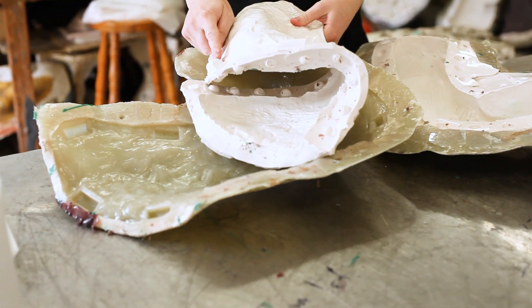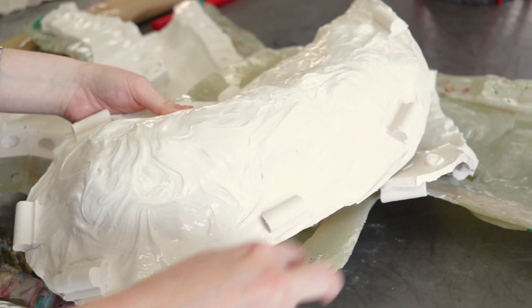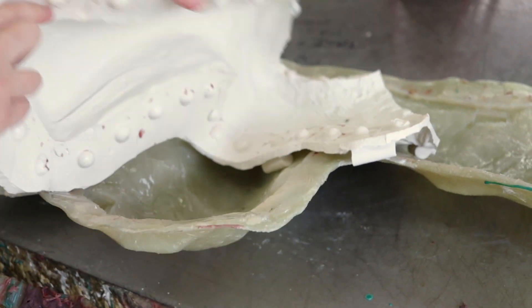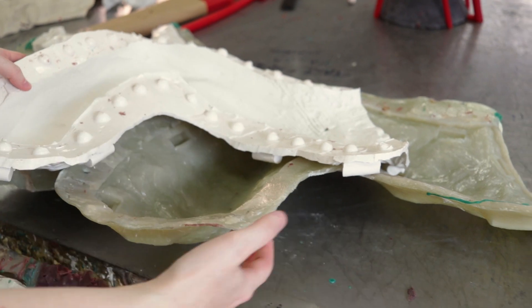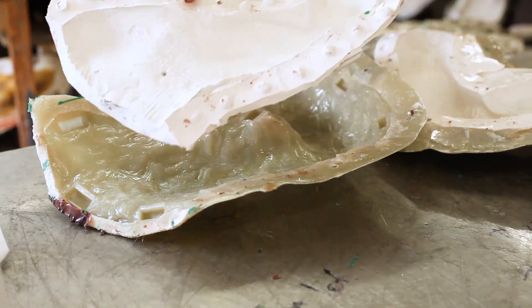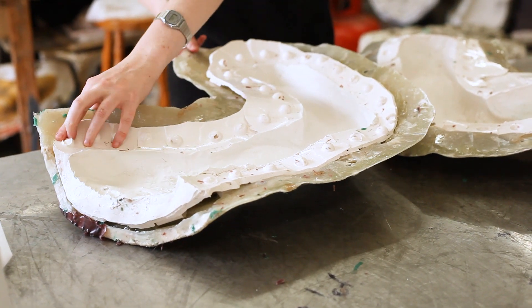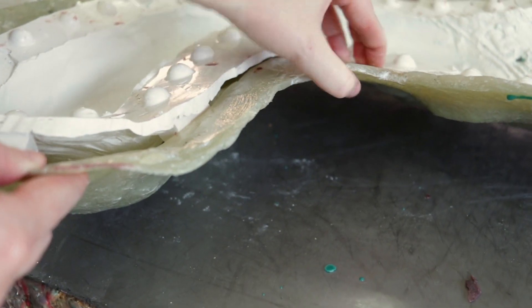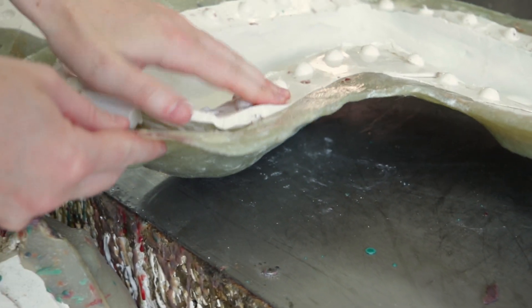We attach these keys onto the back. These keys are important for the next product that we apply to be locked into place. So this is a resin and fiberglass jacket that supports the rubber shape. It locks into place so that when we paint or pour a wax into this mould, it's well supported and keeps the original shape — just locks into place.